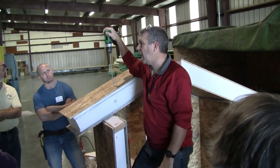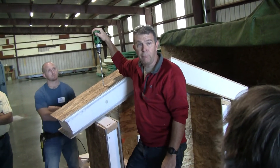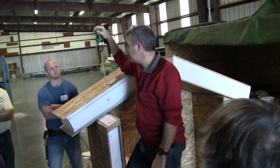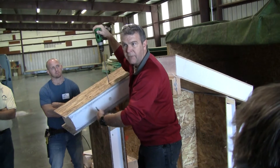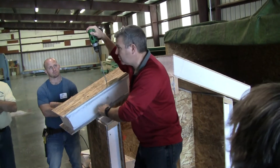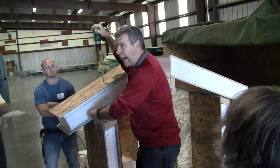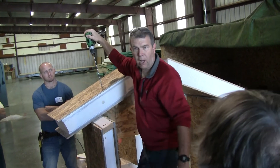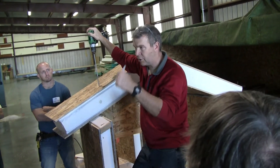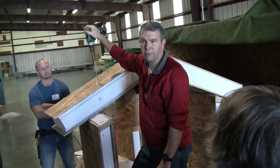I've had three different projects where I've been called back. Fortunately, all of them were roof panels only, and it was the stick framer who built his stick frame wall up to the roof panel and didn't properly seal between the stick framing and the roof panel. There was no seal whatsoever, and the air went up underneath the T&G ceiling that had been applied until it hit a dew point. The water started dripping on the guy's Sunday morning paper. And it happened three different times.